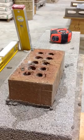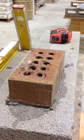So this brick I laid in the previous one. What I have to do is make sure your mortar is still good — that's good right there. If it's a little sandy, you're going to have to add a little bit of water through the volcano and add water. So what I do: you make sure it's in a ball, push away, and then you scoop it or cup it, some say.